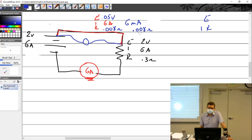I don't think you would see the same resistance because you're not running the same amount of current through it. But just for fun, what would the voltage drop have to be to get that? 0.048 millivolts. You're going to have a hard time measuring that. That's why I gave it 6 amps to begin with, so you could see that. When you start getting up into amps, that's something you could do with a starter wire, but you're not really going to do it with nav lights and stuff.